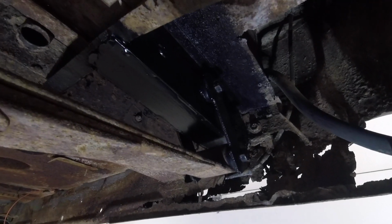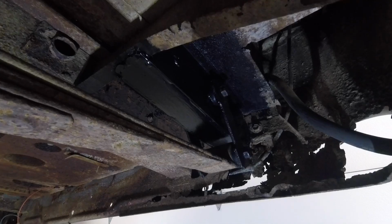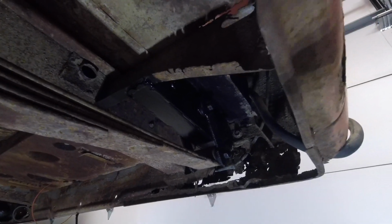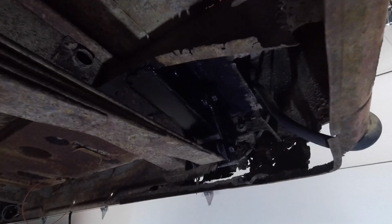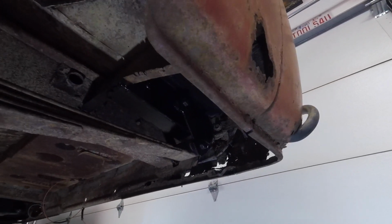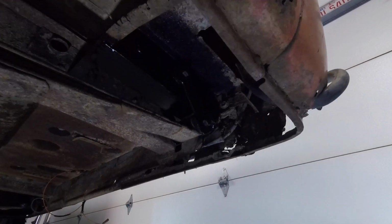But what's important to note here is once I dug it out and got in there, the actual mount in the frame, for the shackle bushings, is a much heavier material and is tied into the box floor. So really what was back here was pretty much cosmetic, which was a good thing because it meant that I could come up with a solution.